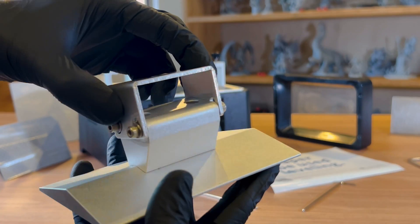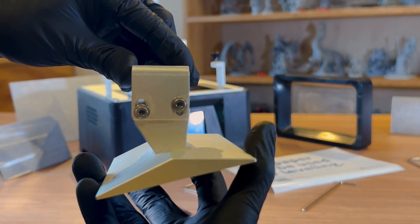This is an initial and crucial step that we must do before we start printing anything. The first layer is the most important in 3D printing, and any problem with the alignment of the build plate can end up causing problems in the rest of the print.